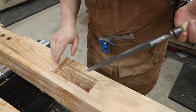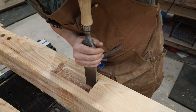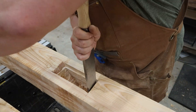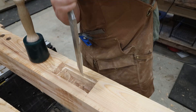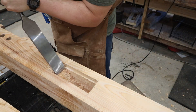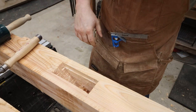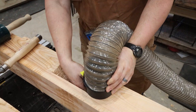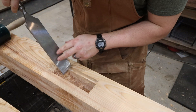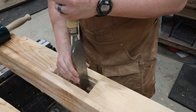This is a nice flat back, so I can just cut it out — we're going to slide right down here. The weight and the pressure without a lot of hammering goes a long way. At this point we've really got to check as we go. We're looking pretty good. We take our chisel and just check our width all the way through. It carries all the way through — it's a little snug in a couple spots.